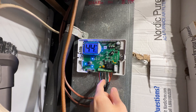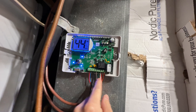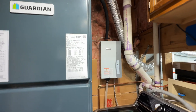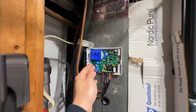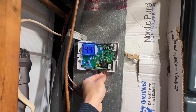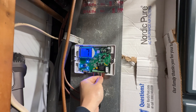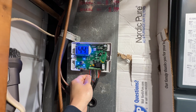The next two wires are the two H wires — they both say H under them. Those two wires just go to the humidifier on the right and tell the humidifier when to turn on and off. Once the humidity is too low in your house, it sends a signal to the humidifier to turn on, and once the humidity has reached its desired set point, it will automatically tell the humidifier to turn off.